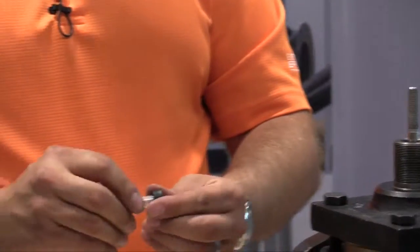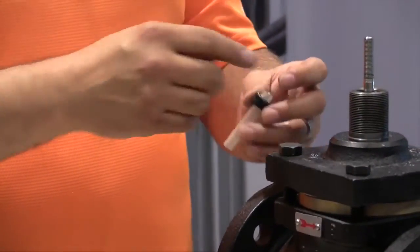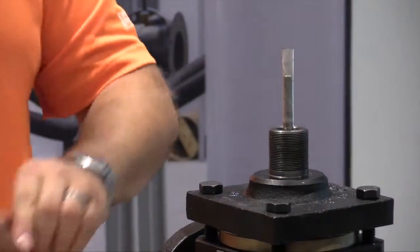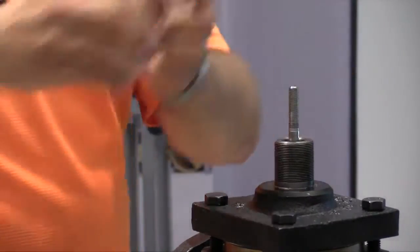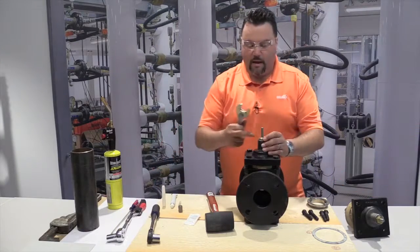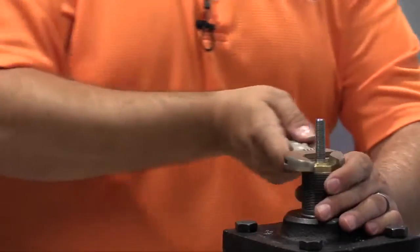Now on the last O-ring, as we put the straw in, we want it to be face up. This is also very important. The first 2 O-rings were down, the last one is face up. So that's 2 down and 1 up. And again, we take the insertion tool and tap him down all the way. From here, we take the packing nut. Once the packing nut has been put in hand tight, take your adjustable wrench and tighten that up until it bottoms out.